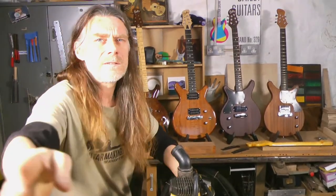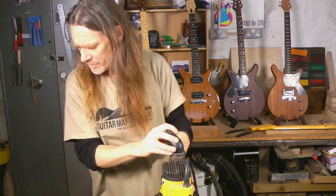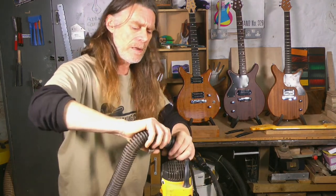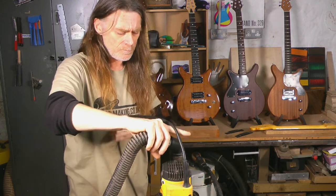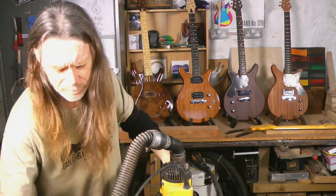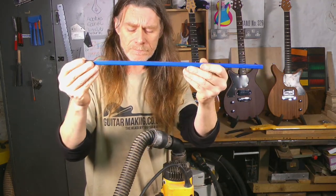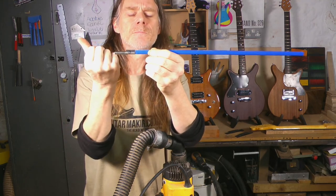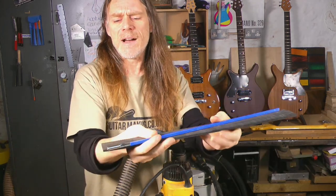Well, it was just that Matt Beals asked a question which is worth answering now. Hi, Matt. You might have asked it or you might have sort of covered it, so forgive me. Right, hold on, I've just missed the first line. Right, so Matt Beals is saying, how far back can I install the truss rod from the nut line? I want to have the smallest channel on the headstock as possible so it's almost hidden. You need to have the adjustable part, where it starts bending from, needs to be past the first fret. So this would be bad.